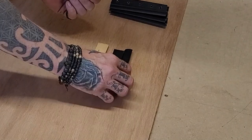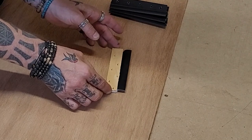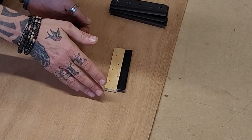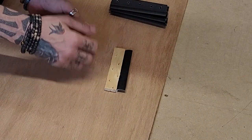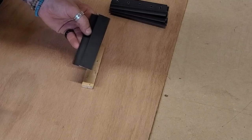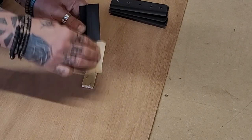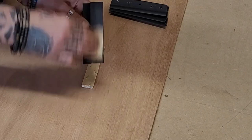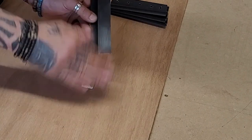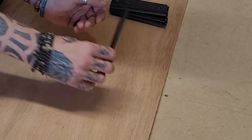So the Z bar, if I put that on the floor, adhesive underneath, then gripper on top, I've actually got two points of contact. So the Z bar to the subfloor and then the gripper to the Z bar. If I was to do it that way, what I'd want to do is basically rough up the back of this Z bar just with a bit of coarse sandpaper, and then make sure you wipe away the dust. That'll give it a better key to the subfloor.